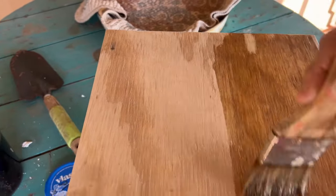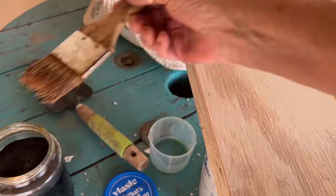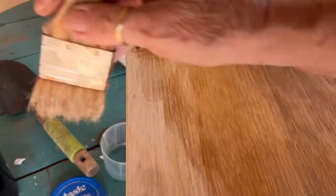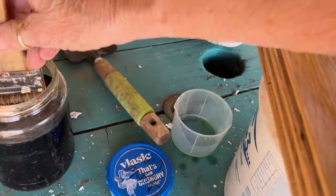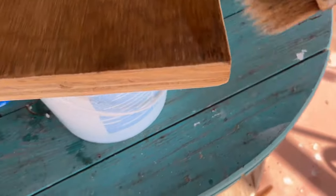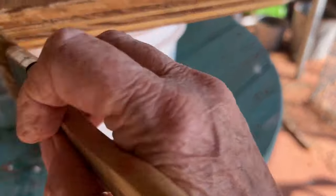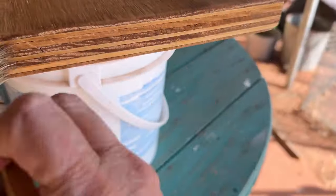On the post, I went ahead and put a coat of polycrylic on it — it looks nice. On this base here, I'm putting this vinegar solution — well, it's just vinegar. I had steel wool sitting in it for about two weeks or so, then took the steel wool out. The mixture was turning dark, and now I can use it to age the wood. It'll just make it look old. There's so many different kinds of wood here, I don't know what it's going to look like, but we're going to see. I'll end up probably putting some polyacrylic on it.